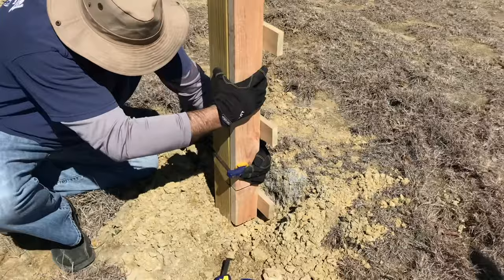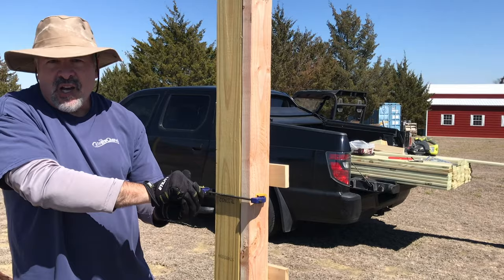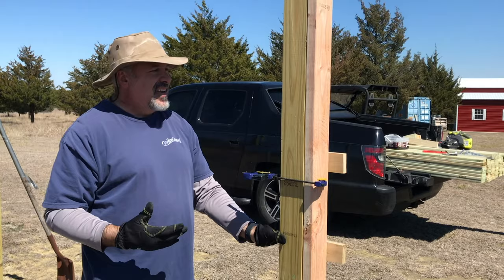You've got to make sure the jig is attached really well, because if it's not, you put your boards on and some of them are heavy — pressure-treated boards still have a lot of moisture in them — and the jig can slide down and throw everything off. That's the voice of experience: then your wife makes you take the boards off and straighten them again. Nobody likes doing it twice.